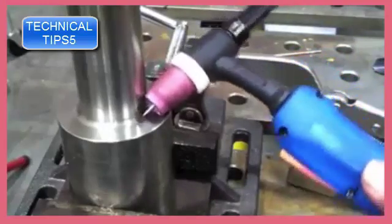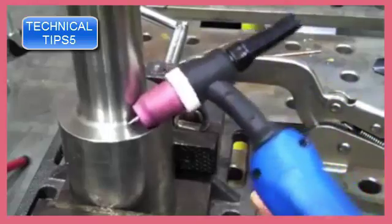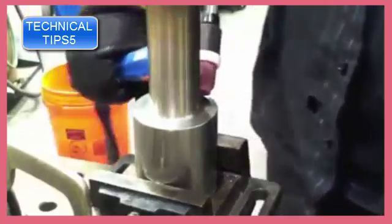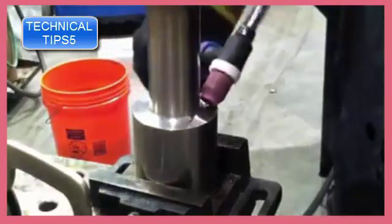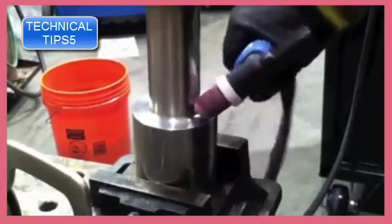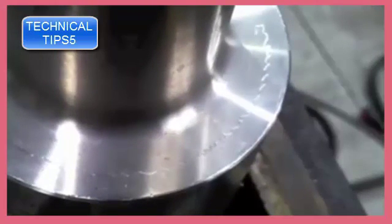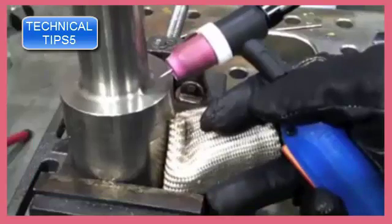So I'm going to show a little walk in the cup technique today on this thing first, and then we'll do some freehanding as well later on in the final pass. The walk in the cup, the first pass is actually more like wiggling the cup like this, just wiggling it. And it leaves scratch marks like this, so it's not actually tolerated in every industry. Like if you're doing fine, tedious work for the semiconductor industry or fine, smooth machine surfaces, it's just not tolerated.